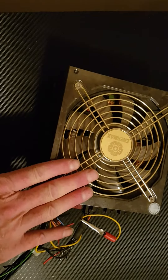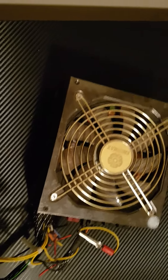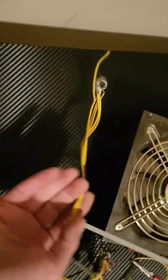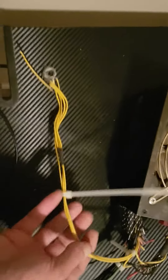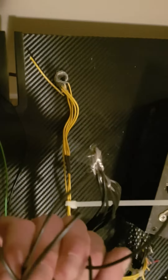I've been using this thing for years — it can do a lot of cast iron. Now the main things for the power supply: you want all of the yellow wires. Right now I've got about six or eight yellow wires put together, and all the ground wires put together. More is better to handle the amperage.